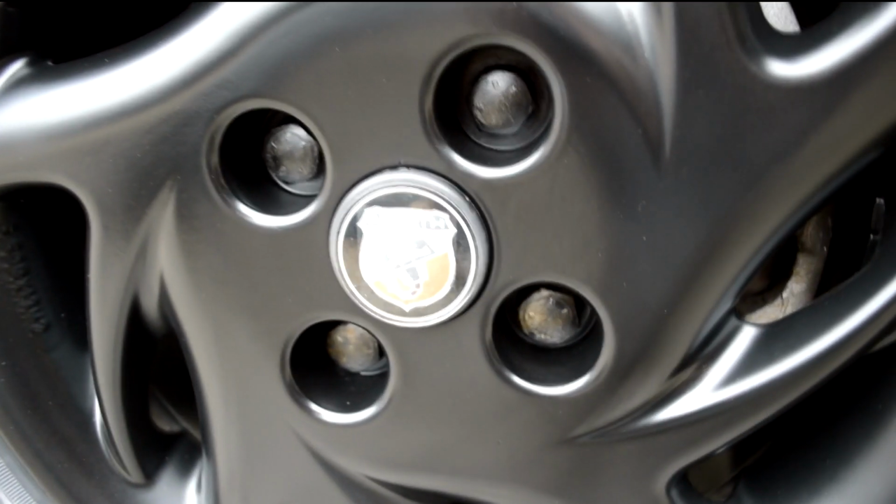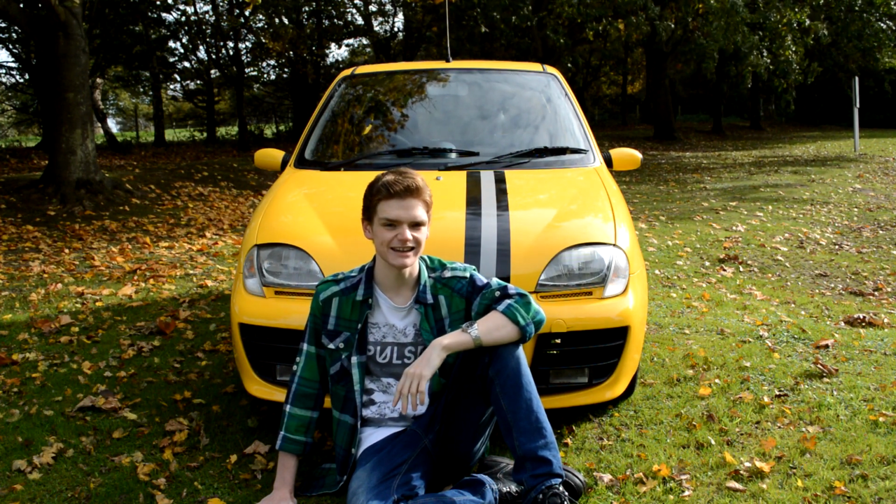In fact, they look every bit as good as they first did, which brings up 2 points. Number 1, don't put lacquer on satin paint because it will turn out gloss, and number 2, don't always listen to what people on the internet have to say.